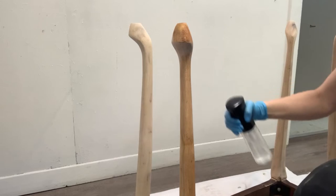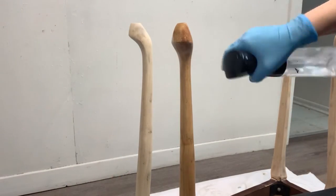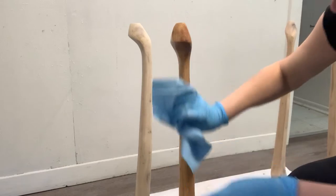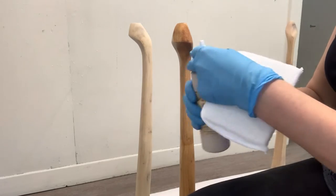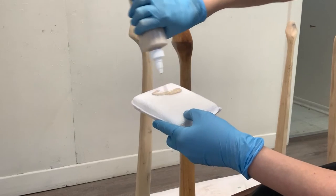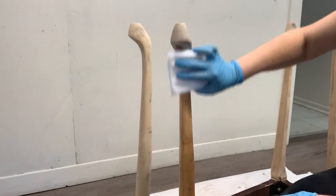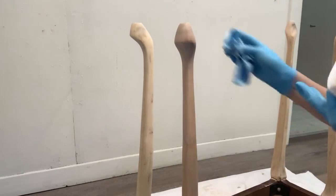For staining these gorgeous long legs, I used a water-based stain called Eau Natural because I wanted a natural finish. When using a water-based stain, I like using a free all-natural wood conditioner - which is just water. I'm spraying with my spray bottle, giving it a mist, wiping the excess water off with a shop towel, then using an applicator pad I rub the Eau Natural stain into the legs. This natural stain is gorgeous - it's brand new and already one of my favorites. I'll include it in the description. Once I rubbed the stain into the legs, I used a shop towel to rub off the excess.